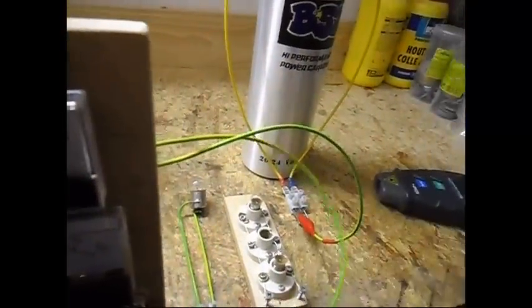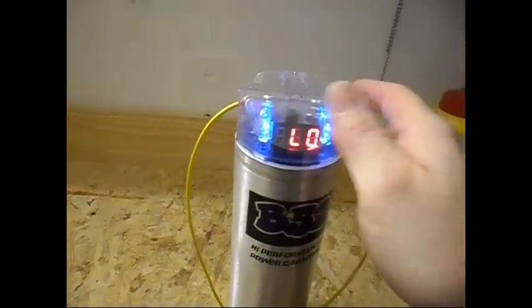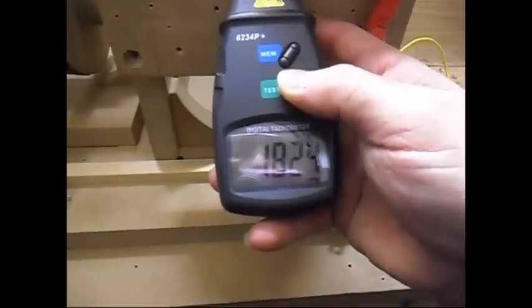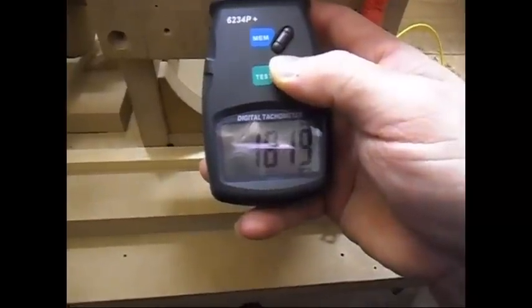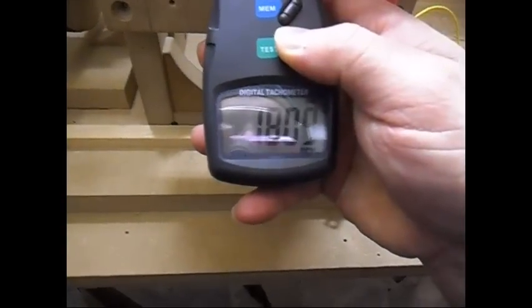Now I'm going to test the capacitor. I'm filling the large capacitor now — you can see the voltage. When it reaches 10 volts this digital meter will also turn on. Let's check the RPM — it's a little bit lower now, 1322 and decreasing. So there is a catch: filling the large capacitor with the small capacitor on the high side of the AC line is not really a good idea.